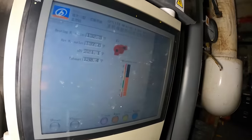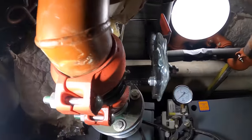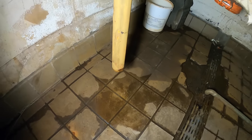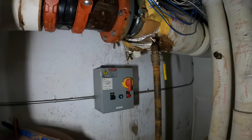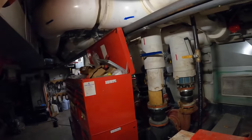Water is still warm. Let's go check the chiller. Here's the chiller — they got everything off right here. This is an absorption chiller that does heating and cooling. They got two of them. They shut that down, shut down the pumps. Here we have a bunch of valves that are closed — heating water, got that valve closed, got this valve closed. Same setup on the other side, we got this big valve closed. And look — no more water coming out of here. This is in the basement but we're up on the first floor mezzanine, and there's still a bunch of water flowing, which seems a bit strange.